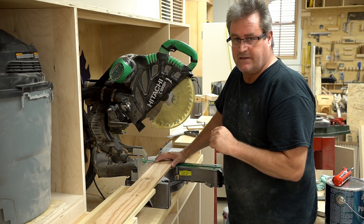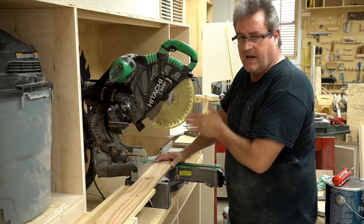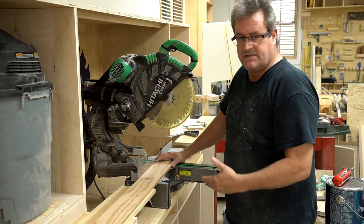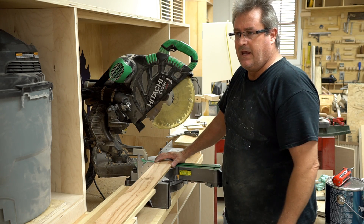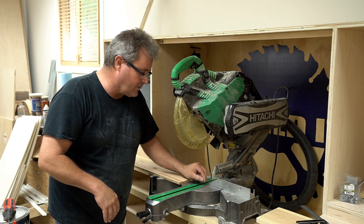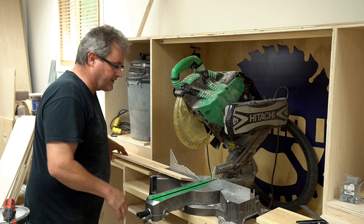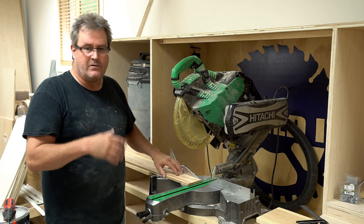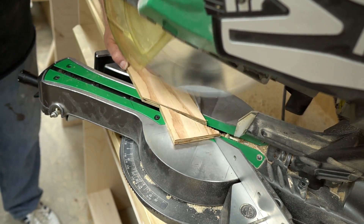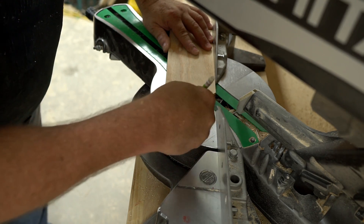As it turns out, the vertical is still in perfect alignment — I didn't have to do anything with it. I made the cuts to check it and double-check, which is a good thing to do every once in a while. Right out of the box this saw was set up perfectly for 90 degrees to the bed, and I've owned this saw for more than six years — I bought it in 2008 or 2009. Now that it's all set up, I'm going to do one more thing: I'm going to make a series of 45-degree cuts into kind of a picture frame, then put it together to see how well it fits. To get the parts to the same length I'll just make a mark on the bed to line them up.